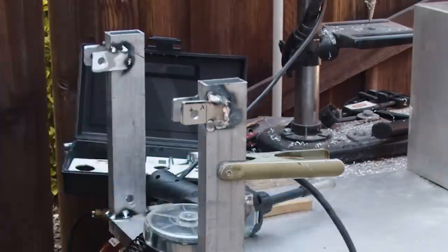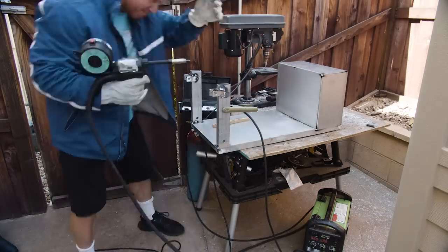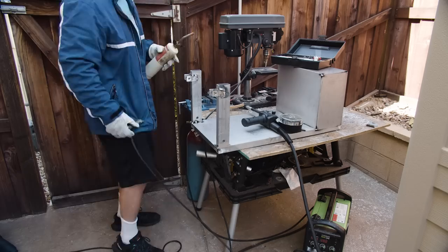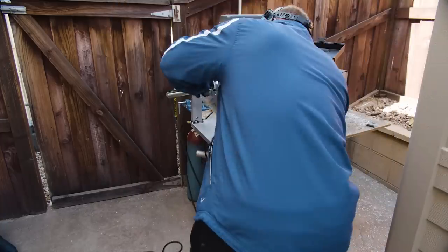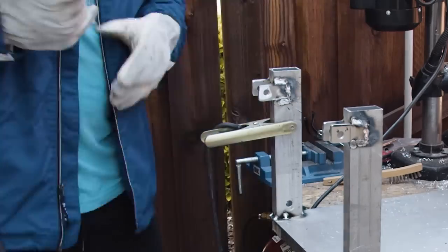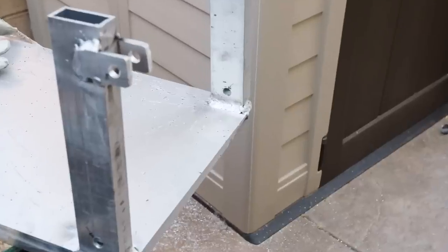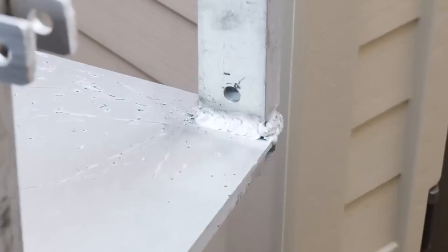We're going ahead and actually doing some welding now. So I had to preheat the aluminum, and now we're actually paying attention to the welds. Before it was obviously just tack welds. So it takes a lot of preparation and time here to clean the metal. Aluminum is not easy. You need to brush it, clean it, and heat it, and then push the welds each spot. And when you're done, you should get this nice metallic silver looking weld that's bonded to both metals.